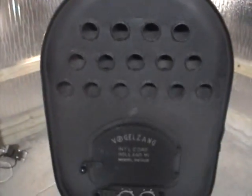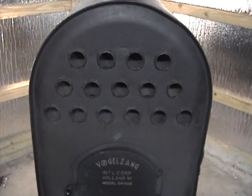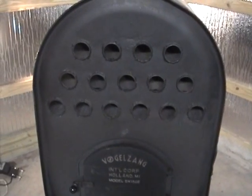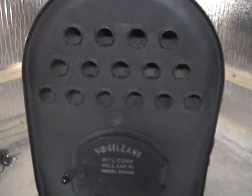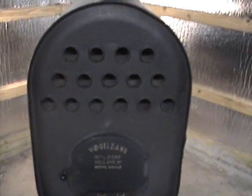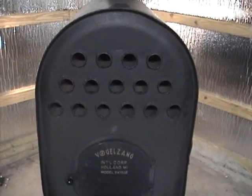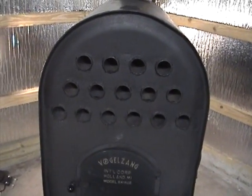I took a 2-inch electrician's knockout punch and an impact wrench, measured out the holes, and cut them in the front and the back. Then I used sections of schedule 10 pipe — it was sprinkler pipe, a thin wall pipe. I wouldn't use anything lighter than that because these will get red hot if the fan's not running. Anything smaller may burn through or sag too easily.